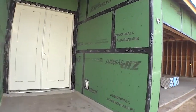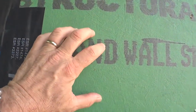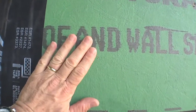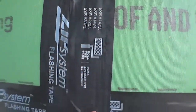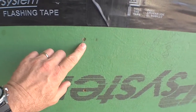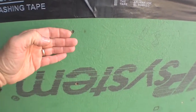Let's take a closer look. We'll go up in the foyer of this home — you can see it's that OSB but with the impregnated coating on it, which keeps moisture and wind out of the house. They seal it with tape and it makes it completely watertight. They don't generally have to cover the nail heads because unless the nail goes all the way through, it's still sealed — the glue goes all the way through as well.